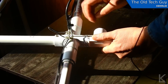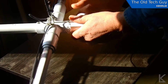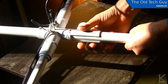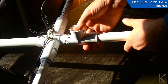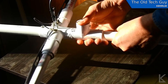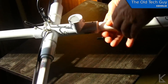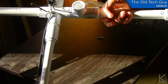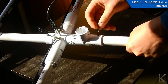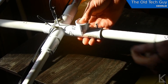Speaking of orientation, this piece here is a little hanger — you take the screw out and it just slides along and holds the PVC. That's what I connect my mast to. I can rotate that so I can have the antenna horizontally oriented, or rotate it over and have it vertically oriented. Then I just drilled a hole through and put a screw in there to lock it in so it doesn't want to move. That's how I can rotate it horizontal and vertical.